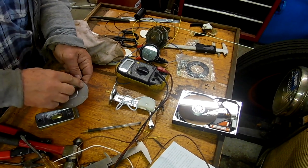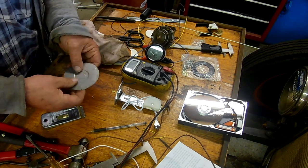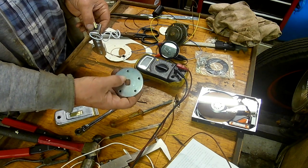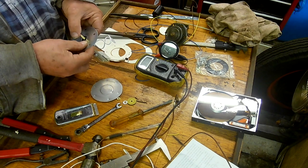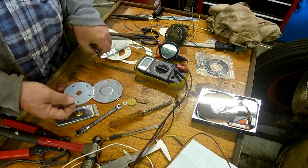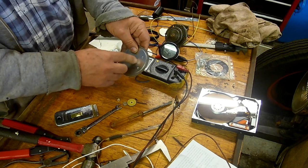Those are my six holes and that's the direction the float needs to go in. So I need a hole in the middle and six holes there. It's not very flat — oh well, I'll drill it and then hammer it flat. I took this top off and noticed it's got a rectangular hole there, and I noticed it's at 90 degrees to the direction of the float. So I need to drill that hole and then file it to that shape.